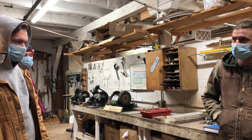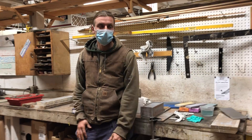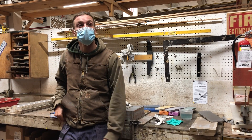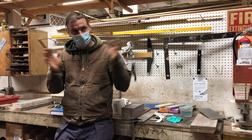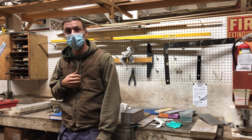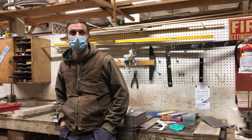We use the 610 on deck beams — like when you're laying down a plywood deck and laminating it down to the tops of the deck beams, you just run a bead from the caulking tube. That's going to set harder, whereas the UV is kind of rubbery. With polysulfides, they have a really high modulus of elasticity and generally a very long cure time as well. They're also workable underwater for quite a while — they won't necessarily bond to wood very well but they'll harden underwater, which is the glory of boat life.